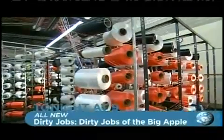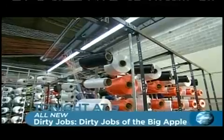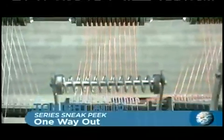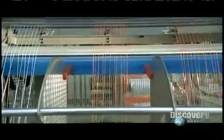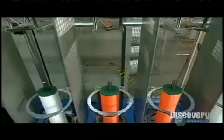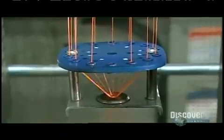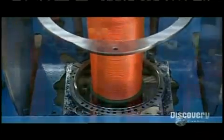Now, dozens of spools of nylon fiber unwind at the same time to make jackets to protect the core yarns. The fibers travel several feet over a network of rollers, controlling tension on each individual fiber. They pass through distribution plates as turning bobbins below twist the fibers into yarn. A platform moves up and down to evenly wind the yarn onto the bobbin.